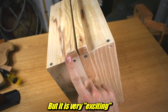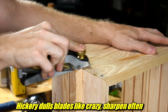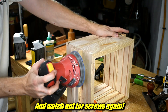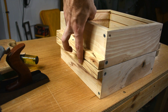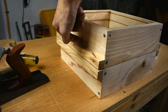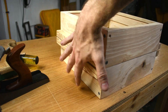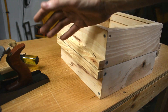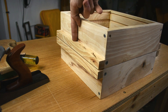The next feature is that the flange surfaces line up perfectly. I achieved that by sticking them all together and then planing and sanding them down so they're dead even. The reason I did that is so when I'm lowering the top flask onto the bottom, I can feel through my fingertips if the top is shifted one way or another — if I have a thumb sticking out here, I can tell if there's any offset in the other dimension. I want to be able to just set the top and bottom together without having to shuffle them around.